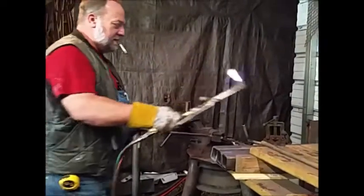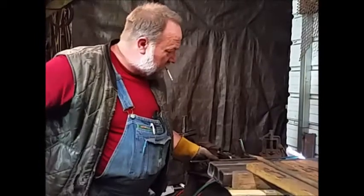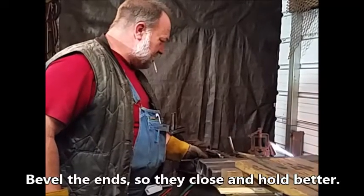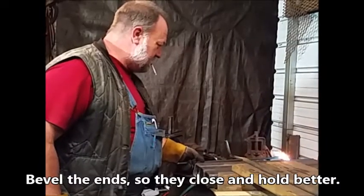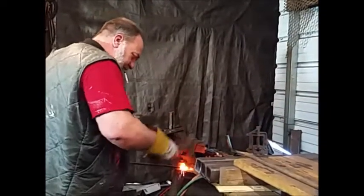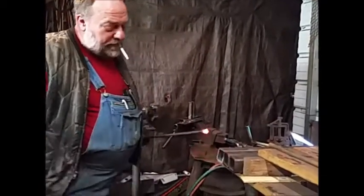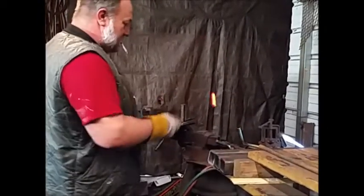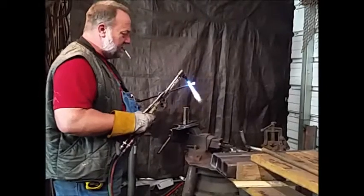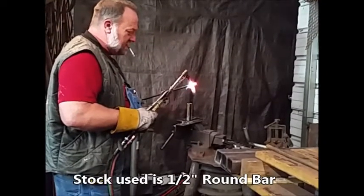To start off, I'm going to lay my torch down and bevel that end a little bit. I'm going to heat up just the end of this thing for a second. Whenever you clamp them down, they're leaning back against each other — works a little bit better. First thing we're going to do is open up a small bend, half-inch radius, for the safety chain to hook into. Good start.